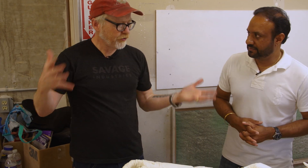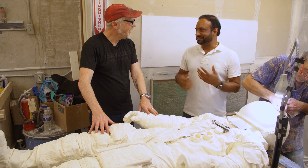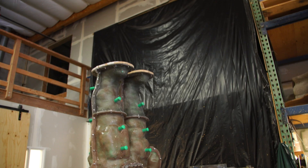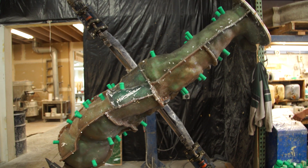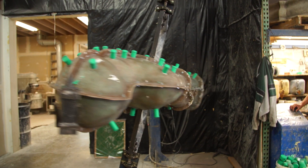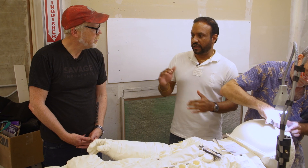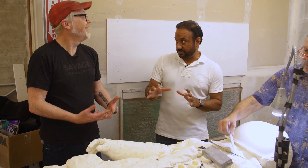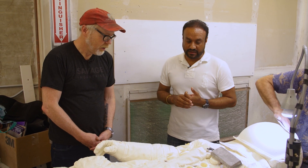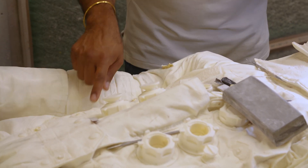You made a large fiberglass and silicone mold — and how do you cast the resin, you pour it in? Well, we pour it in, go through a few processes, and it's built layer by layer — it's roto molded. You have a roto molding machine big enough for this? We can do twice as big. And you also had to choose a resin that was dimensionally stable — that was some R&D on our end based on how much detail we're capturing. We blend our casting material, and here with so much detail, we had to blend it thinner to capture more at every turn. Things like these thin walls and cut ends — for a big silicone mold, peeling it off requires really careful work to not break the silicone or the resin.